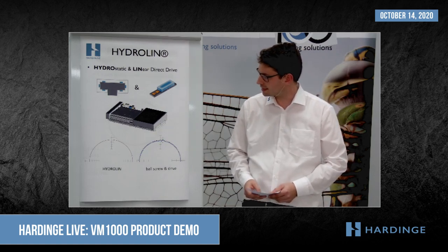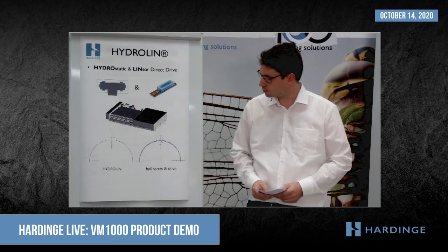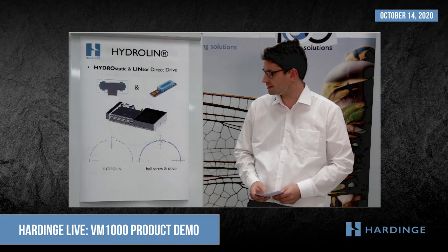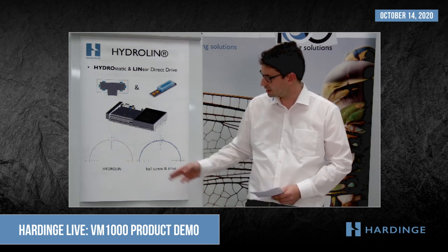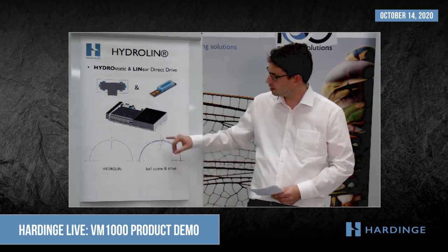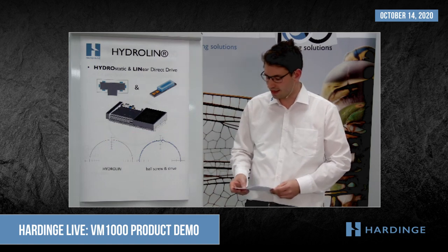Down here, I have two plots. These are circularity tests made by the scale of the axis unit. On the left-hand side, one by Hydroline, and on the other hand side, one with a ball screw axis with a classical drive. As you can see, the circularity of Hydroline is very smooth because of the good controllability. On the other hand side, we have a not so good controllability, and at the boundary of the segments backlash is clearly visible.